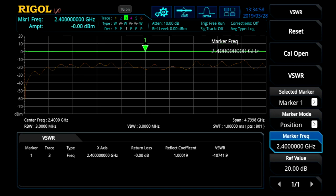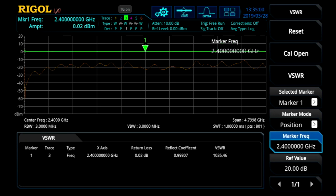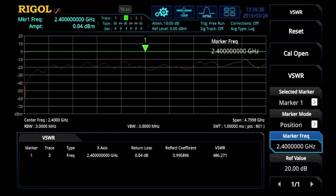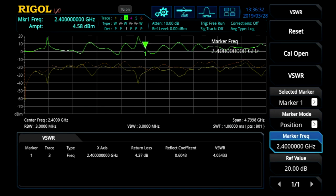Next, we're going to look at the next antenna in that set, which is showing a little shy of two, looking right around 1.9 for a VSWR measurement, which is just fine for an antenna. Next, we're going to look at our two other antennas. Here's the first antenna on the second set, and we're going to see it's showing a VSWR right around 4 — a little bit less, maybe 3.9.